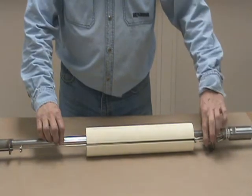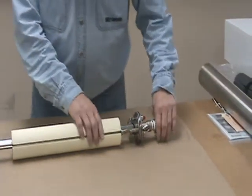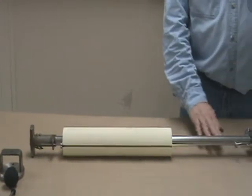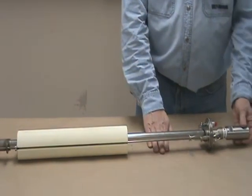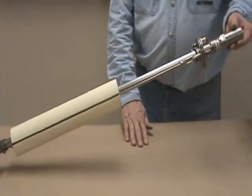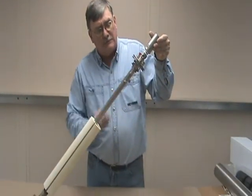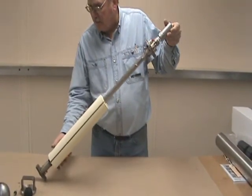There are magnets in the head and magnets in the linkage here that pull it closed. Bring your float gently down to the bottom stop, and then with the discharge tube and the control rod parallel to a flat surface, raise the pump up slowly with this check valve — your discharge check valve. At about 10 to 11 o'clock, the weight of the float will pull the magnets apart. That's a good indication that everything in your mechanism is free to move.